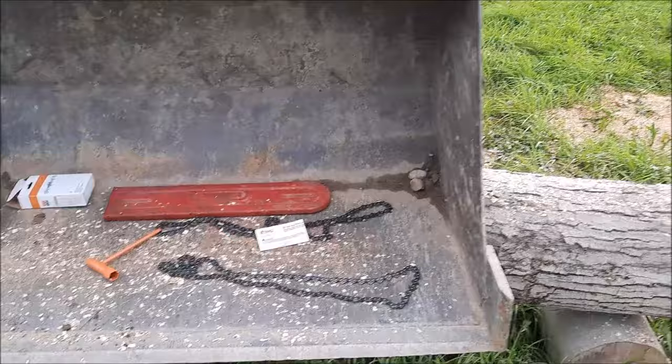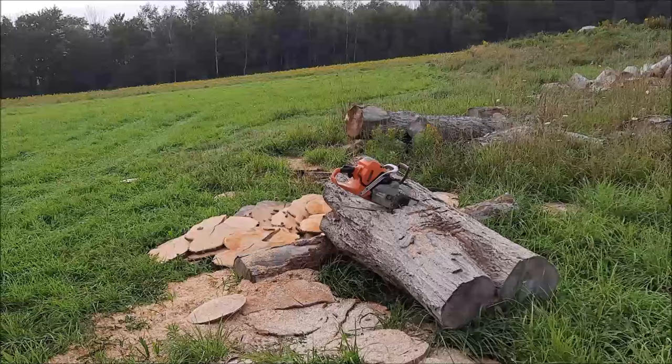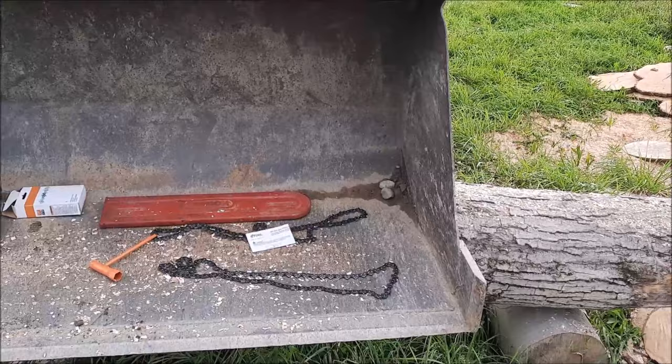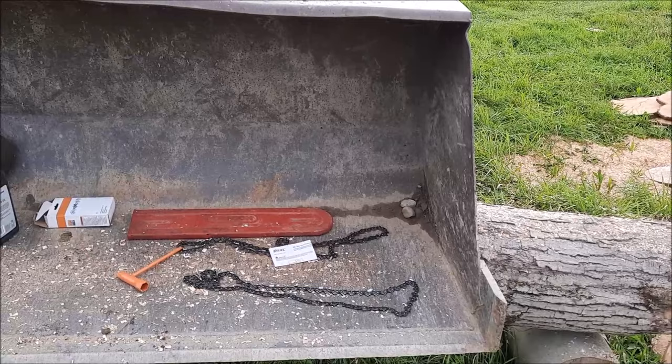And what I found was I had to be very careful when it went from being on the crust to breaking through that I didn't stall the chain. Don't know any other way of explaining it. Whereas I know if I had a bigger displacement saw, I would have just powered right through it. The RS, I think, would cut fastest, in my humble opinion. We'll see on the times. But that transition from not cutting to cutting, breaking the crust feel, is why it sits on the bottom of the stack in terms of which one I would pick out of the box now.